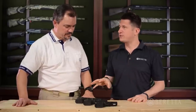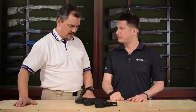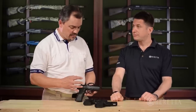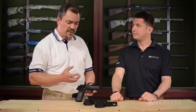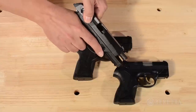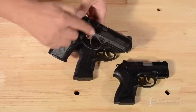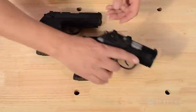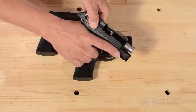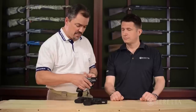We talked about the fact that there's a lot of features in common, but the first thing I want you to dive into is the locking system, which is different between the subcompact and the other two sizes. On the full size and compact, we have a rotary barrel system — very durable and rugged, acting like a bolt-action rifle. Two lugs rotate with steel-on-steel contact against the slide and lock the barrel in, making it a very stable, very accurate system. The subcompact, because of its size, was too small for a rotary barrel system, as it requires more slide length and travel. So in this case, we adopted the more traditional tilt barrel system, which allowed it to be as compact and light as possible.